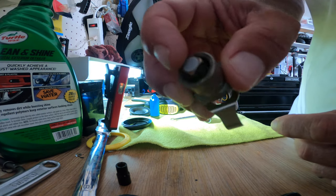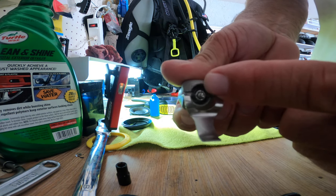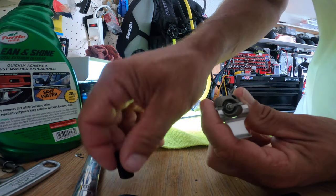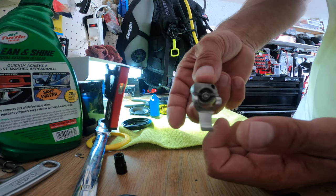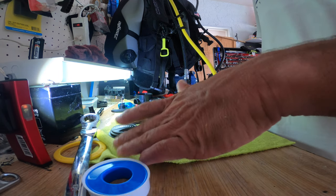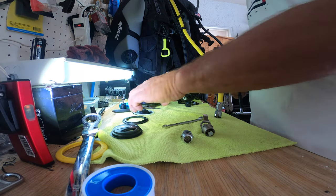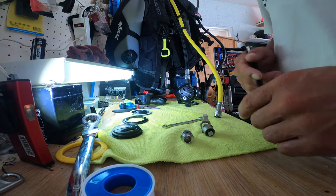I'm going to adjust this slightly so it works well. This little nut that sits there is a quarter-inch - that fits right on one of those sockets and will enable you to adjust it as well. Now we have everything more or less cleaned up - just use a good normal detergent to clean everything up, and I've also treated the diaphragm with a little silicone to preserve its flexibility.